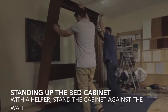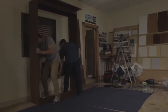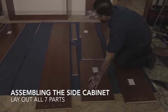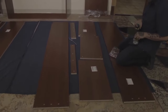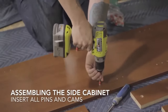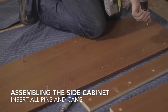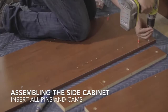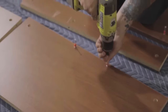At that point you'll be ready to move on to either hanging the lights over the headboard or proceeding to prepare your side cabinets for assembly. The side cabinets follow essentially the same process as the bed cabinet. They will have additional holes for adjustable shelves that are the same size as pin holes but do not get pins in them — those are typically in groups of five. There are also holes for the hinge plates if you have doors on those outer cabinets, and those do not get pins either.